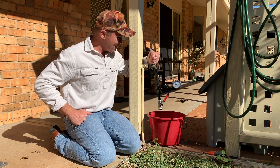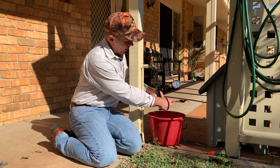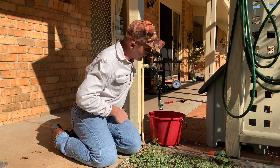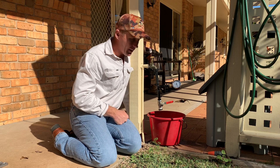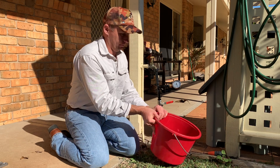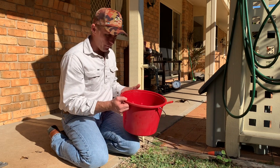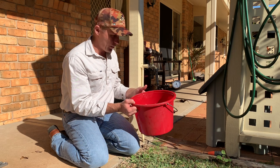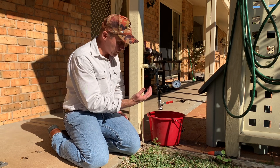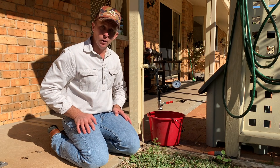So slowly turn on your tap, shut off your valve, and it's going to give you a reading. Once it levels out, we're sitting at about not quite 850 kPa. Then we're going to do a flow test. This is actually a 10 litre bucket but it has litre increments, so we're going to measure it at 9 litres and time how long it takes to fill the bucket and get a flow rate as well. Let's go.